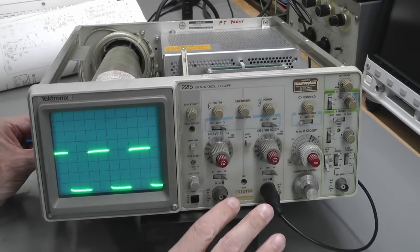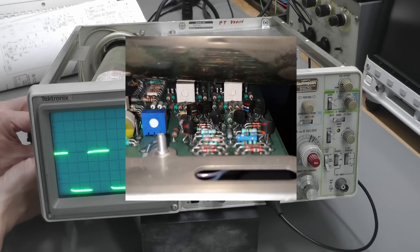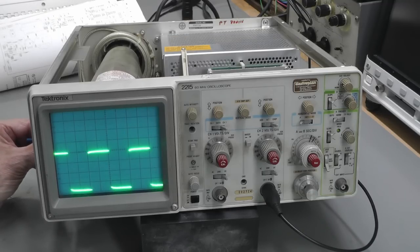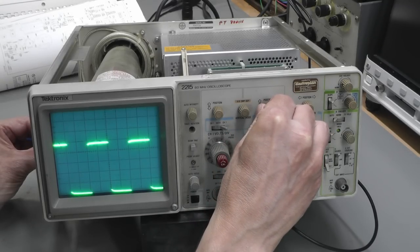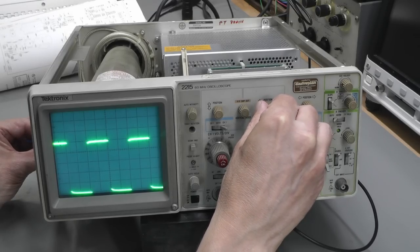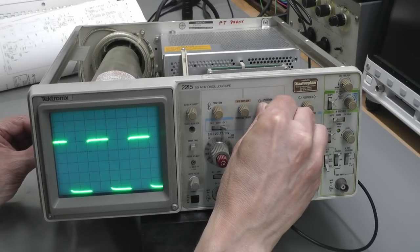So we're doing channel 2. That's R286 on the main board, which I've got my trimming tool into at the moment. So if I just wiggle it back and forward, yep, that's doing something. So let me just bring it up a bit and then compensate it there, or nearly there. Yeah, and I think that'll about do it right there.